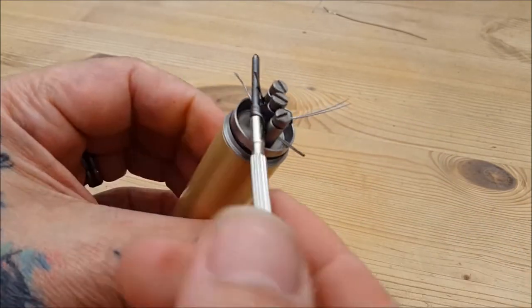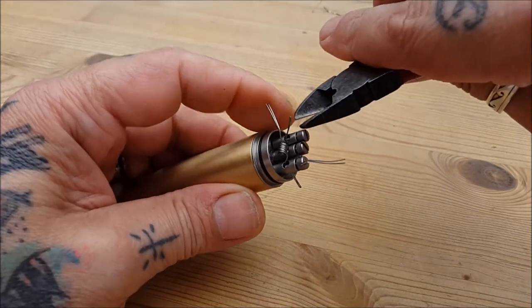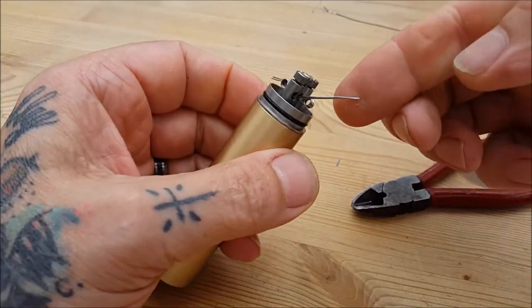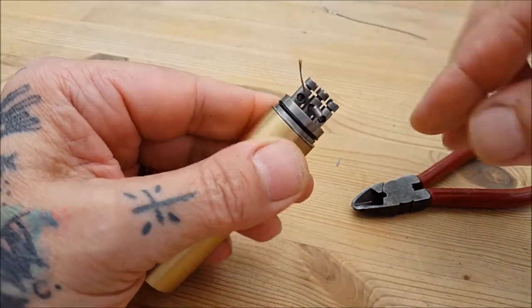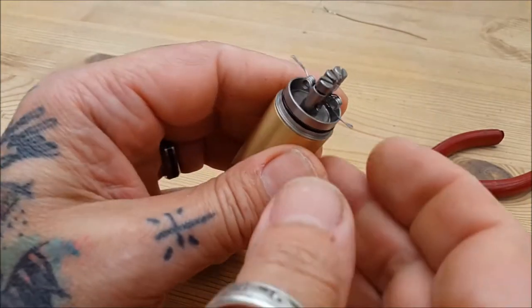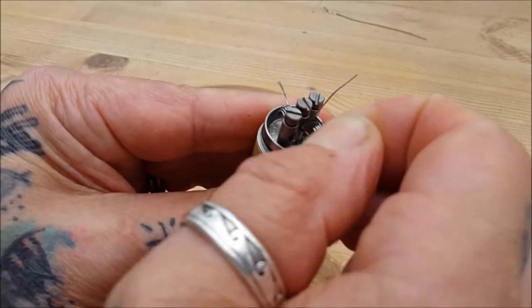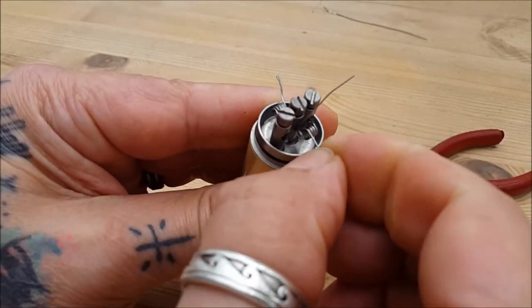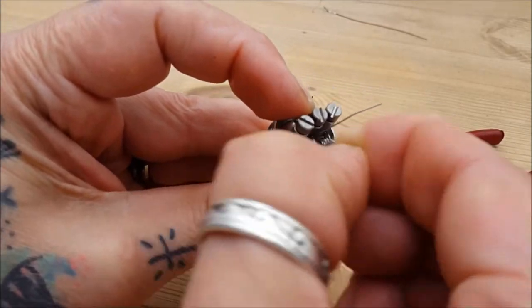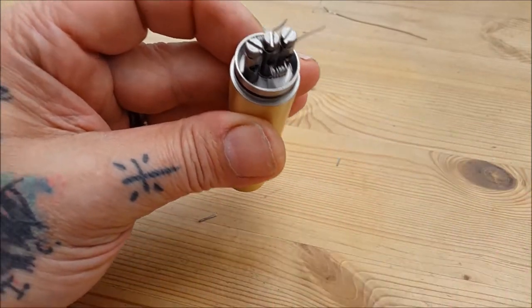Tighten up the middle screw. Get your side cutters and give them an air cut — trim off all those loose ends. The two negative ones are always easy to get to; the positive ones can be quite awkward because you've got two more legs in the way. If you can get in there with the clippers, do. If not, what I like to do is the old twisty pulley — roll it around and around until it snaps off.